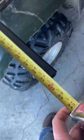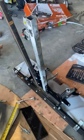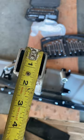What I'm doing is putting new push tubes on the plow, because the original ones are only 31 and a quarter inches. The new ones are 38 inches. I just went and got some one and a half inch tubing, as you can see right there.